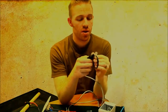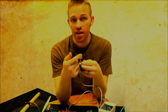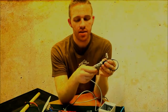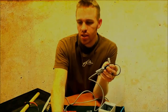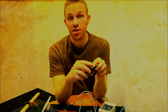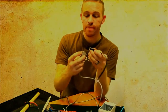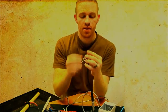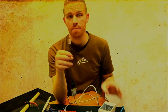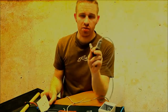Depending on the serial-to-ethernet cable you get, the pin locations on the serial port could end up in a variety of different places on your ethernet port. What you need to be careful of when you wire this up is that you take the RTS pin or the DTR pin from your serial port. I've included controls in the program — which I'll show shortly — that enables you to use either of those ports. You need to pin out using a multimeter or a test light which pins correspond. If you hook this up incorrectly — and there's a lot of documentation online for free as far as pinouts on both of these connectors — you could potentially damage your serial port. So be extremely careful in how you hook it up.